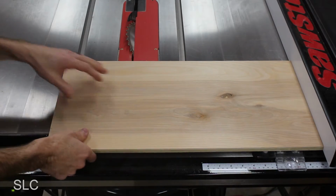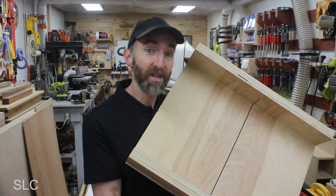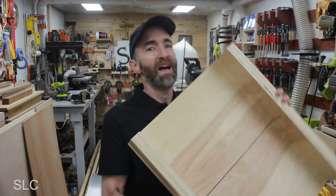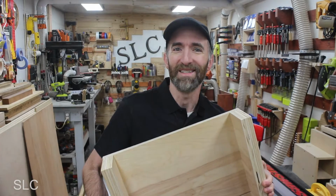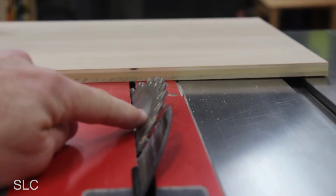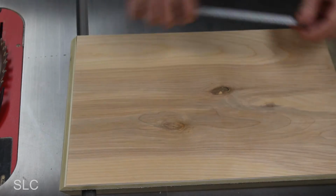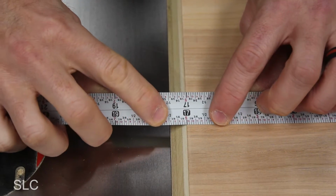And as mentioned before, doing a crosscut on the table saw like this can be very dangerous. And since crosscuts are unsafe, you can always build yourself a crosscut sled. This makes it a lot safer. I actually built this in a previous video. I'll put a link to that in the description. Now the blade's going to be set up for a 45-degree angle at a 17-inch cut. Now let's just do a quick measurement here. And that came out almost perfectly 17 inches.